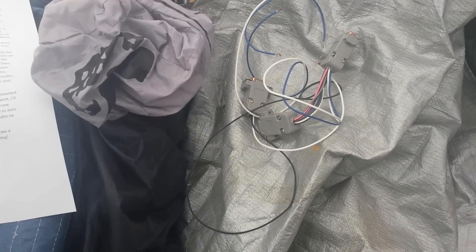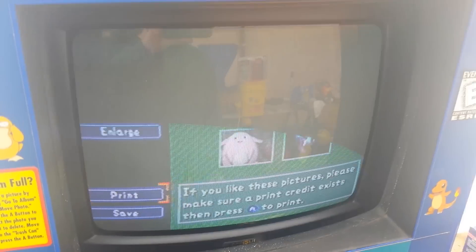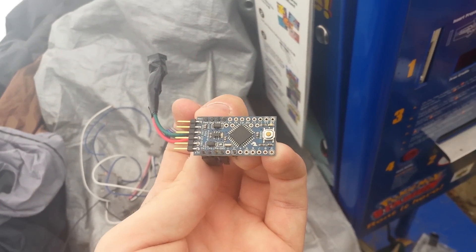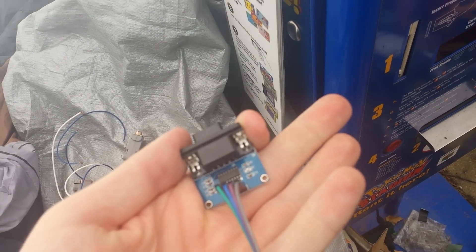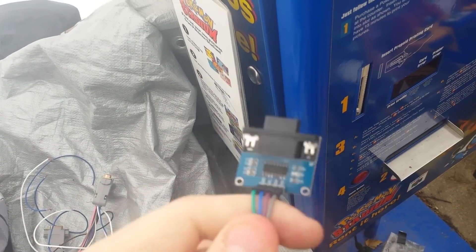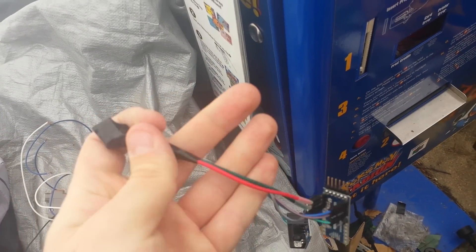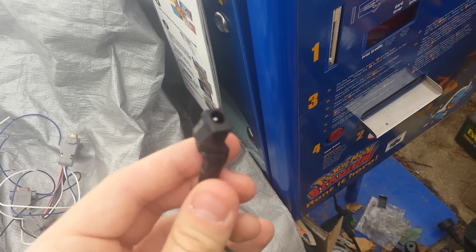Now let's get into the how-to of how to use this system. I'm not liable for any damages this might cause, but if you do everything correctly I don't expect that you'll be able to screw this up. First off, you need to procure three things: an Arduino — I'm using an Arduino Pro Mini because these are like three bucks on eBay, but you can just as easily use an Arduino Uno. You also need an RS-232 to TTL adapter, which are like two bucks on eBay. This converts the signal the Arduino sends to the signal the Snap Station expects. You also need a way to power this — I use the power the Snap Station provides via a standard DC barrel jack.